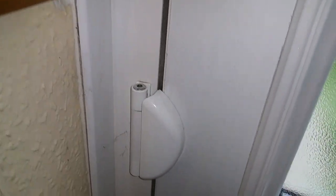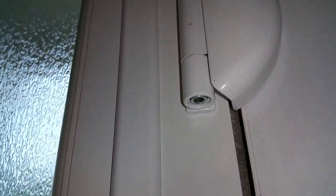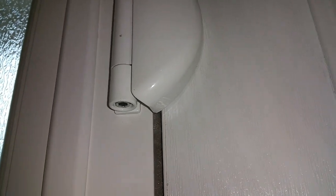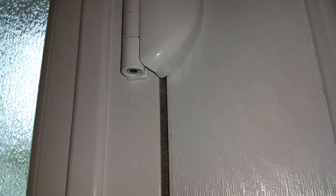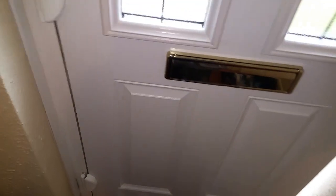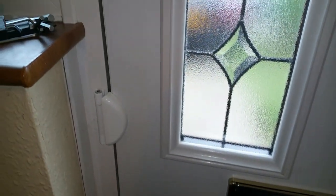You adjust the bottom one — screw in and the door goes up, screw out and the door drops down. I've screwed them out now and the door is completely binding on the lower part, so we've got to screw them back in and raise the door up.